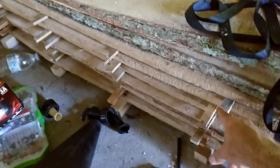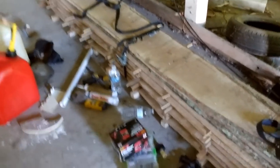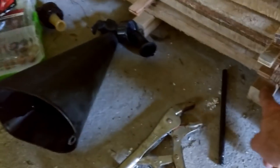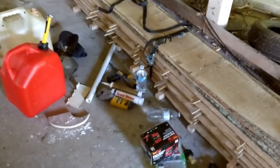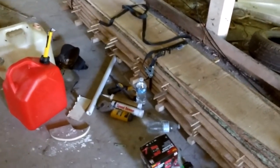These are stickers spaced 1 foot between each one. And they're like, you want them about 3/4 of an inch. And then there, got thicker ones down there. And then this wood is 1 inch thick, so it'll take about a year to cure. This tree died in the spring, so the bark should come off pretty good.